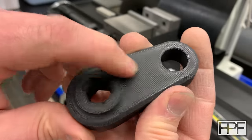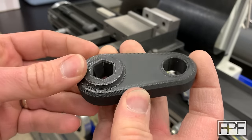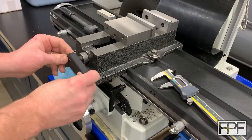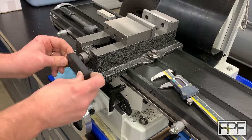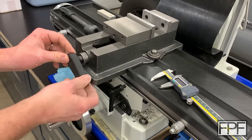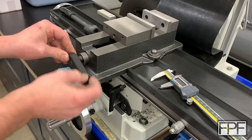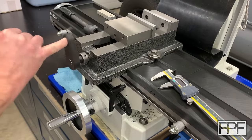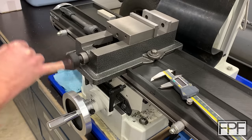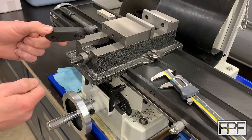That piece finished and it looks really good — came out super smooth. It's amazing how just adding a couple of bevels and round-overs gives a part a really finished look. Let's see if it fits. It's definitely easier to line up with that bevel on there, the fit is still as good as the original, and our shoulder is keeping us away from the vise — we have clearance back there now. I can spin this with my pinky, no problem. I think we have plenty of leverage even with the design shortened. Let me find a piece of aluminum stock and get started on the handle.